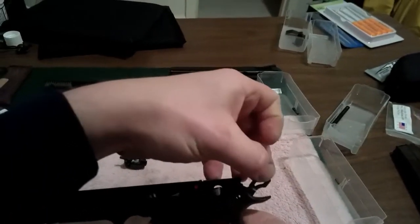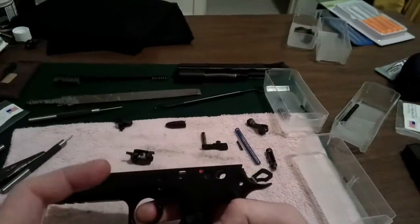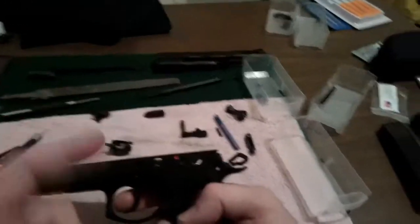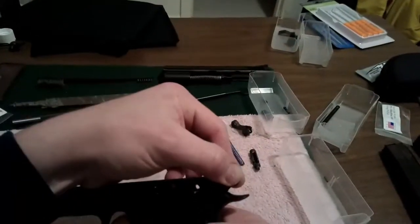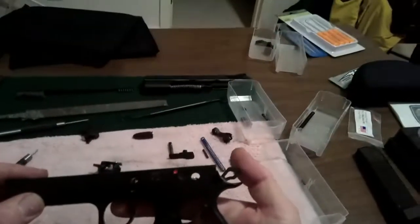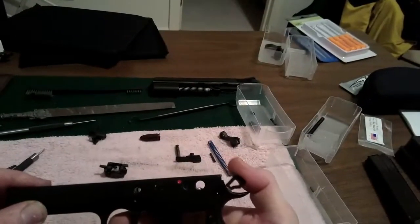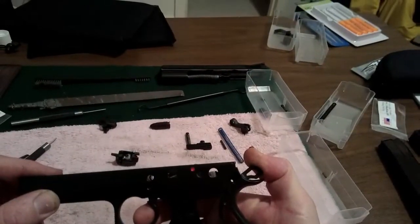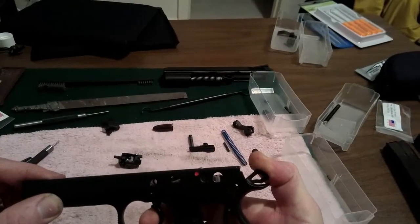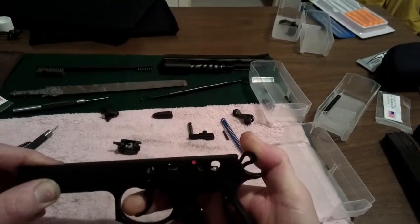And you could go straight into single action fire, but it'd feel gritty, like it was catching on something, because it would release it and then almost pull it back and then fire it again, kind of a doot doot, and then all the way forward. So in single action, you could pull the trigger, stage it right where it would break, it would release it, and then if you slowly let the trigger out, it would also lower the hammer slowly.